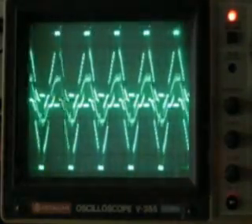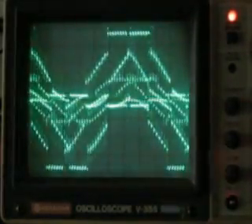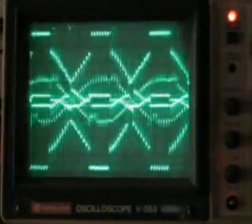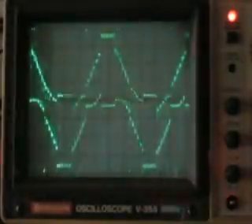The waveform you're seeing is actually made up of a series of square waves. As this motor speed increases, we can zoom out and take a look at those individual pulses. It's getting a little more clear now that it's synced up.